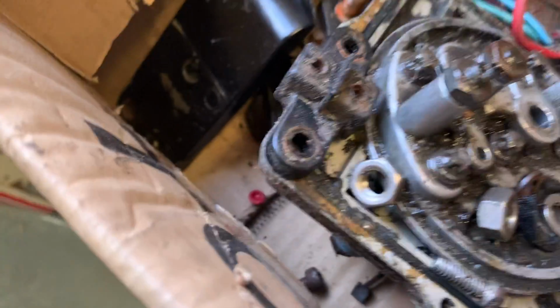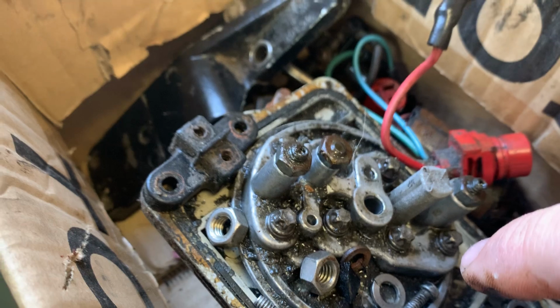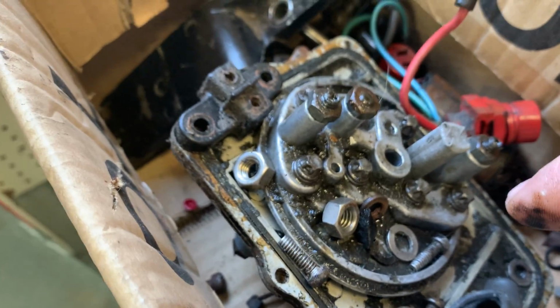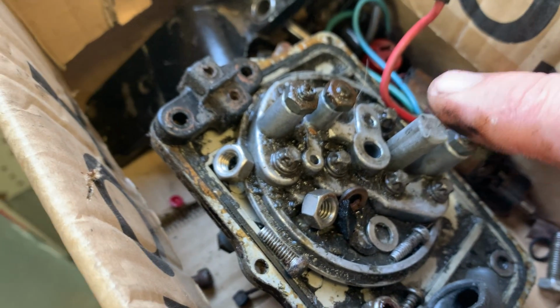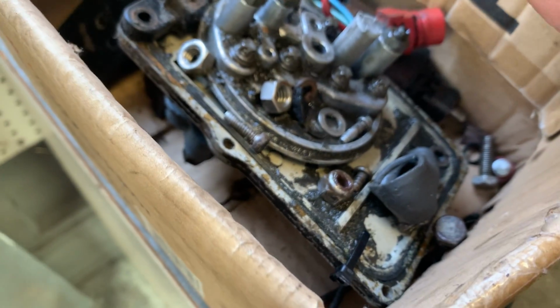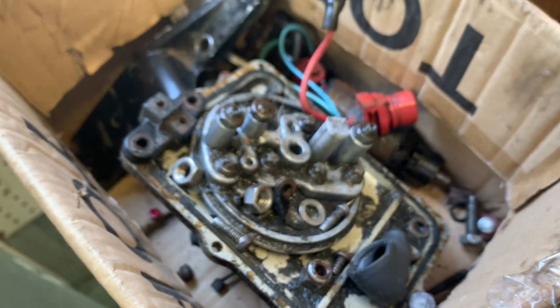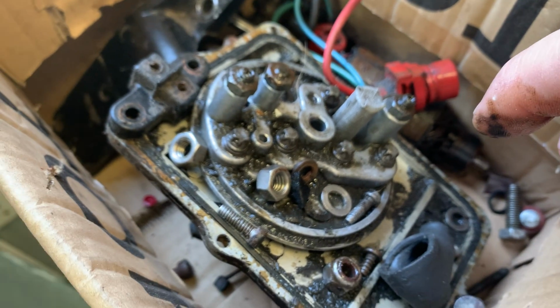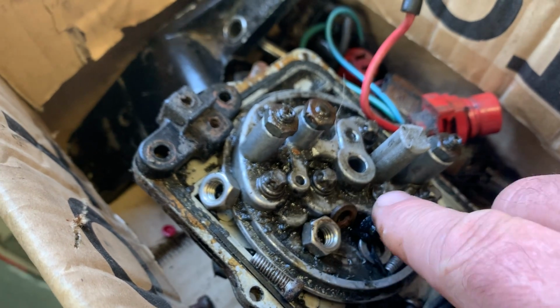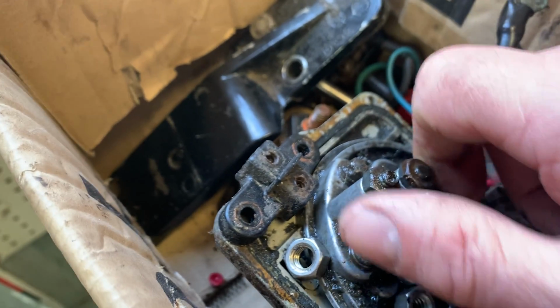This is the pump itself. Now, when you pull that pump off, you need to be super careful. There is a bunch of plungers, springs, bolts, all sorts of stuff, and these little caps that sit on the balls. They all need to be in the right position, and you need to take note. So you need to pull it up about 1 millimeter and start looking and draw where everything goes so that you know. There is some stuff online, but it isn't very definitive. You also need the right external Torx bits to undo that, which I'd have, because they're on motorbikes.